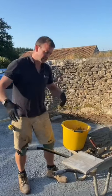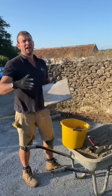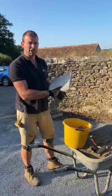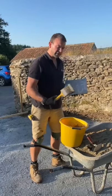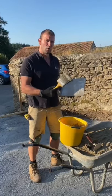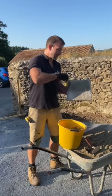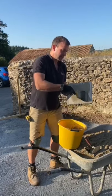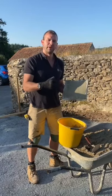The other tip is on the backs of the slabs — especially on natural stone like this, but we do it on all slabs now, just as a belt-and-braces measure. Mix up a solution of one part SBR, one part water, and five parts cement, then just paint that on the backs of the slabs, getting it all over. That gives a nice solid adhesion to the cement.